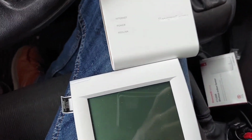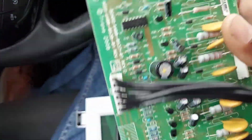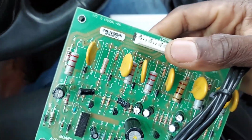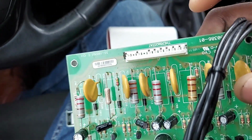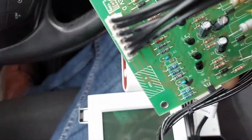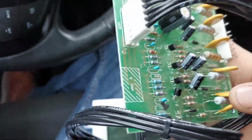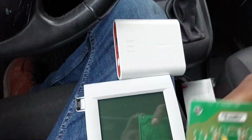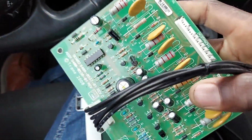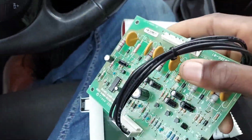All right. What else? This right here, I got a video on this too, on my channel. This is a Trane CTI board, and if you're a pro, you know that Trane comes with its own proprietary thermostat, which doesn't have the regular conventional RGY terminals, like this thermostat right here. So you're going to need one of these boards. If it's a Voyager rooftop unit and stuff like that, they have these numbered terminals for this specific Trane thermostat. You can't use one of these on there. So you have to use one of these CTI, or conventional thermostat interface boards from Trane, to do that. I got a video on my channel doing that already, so go watch it. Go check it out.